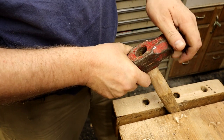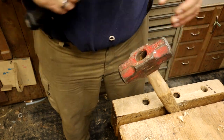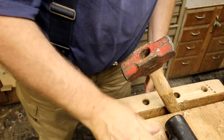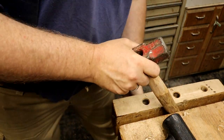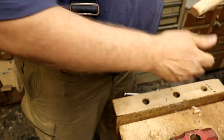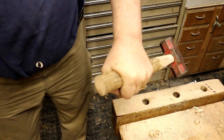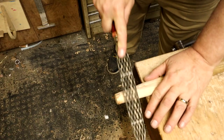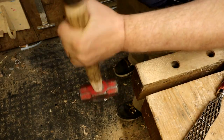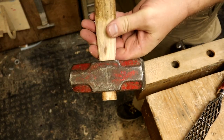I keep hitting it on and checking for size repeatedly. Here I'm using a deadblow mallet to put it on a little bit further — of course it's stuck, so I have to bang it off again and remove more material. Finally got it down to the point where I could actually drive it most of the way on, and I just had some final shaping to do. I chamfered off the bottom of the handle, and this time I set it pretty much where it's going to end up living. Pretty pleased with that — nice tight fit.